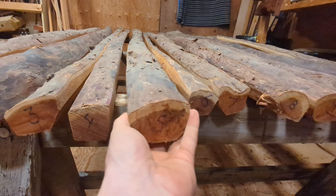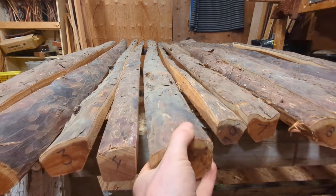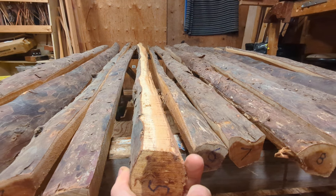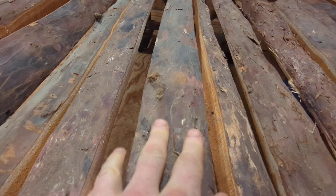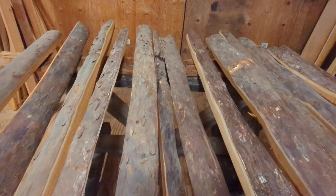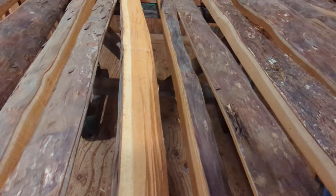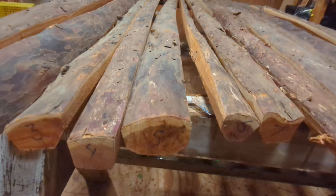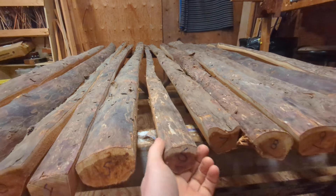Stave number five, 83 inch — again everything's pretty long here. Alignment pretty decent, maybe a little heat bend first, tip alignment. Look at the front to back profile — always working around the knot, snaking up the middle of those two. Other than that, really clean, nice flat crown. A little bit thicker sapwood so probably going to want to thin it out a little bit. Lots of options. That's number five, 83 inch, that's $175.